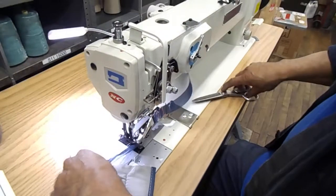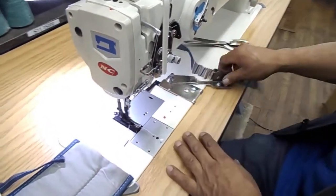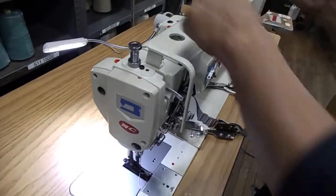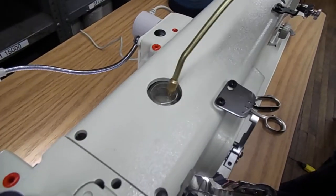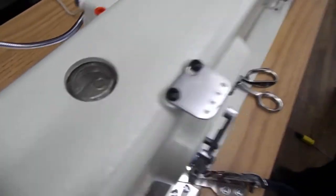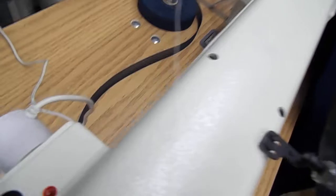Now let's show him how to oil it Jose. There are some manual oiling points on the machine and it couldn't be made more easy. We mapped them out with red nail polish. A couple of drops for every full day. You'll see them sporadically across the machine — in the back there. And there's your big oil fill, and you want to fill that up. Just hunt around the machine, you'll see them mapped out in red. Very simple.